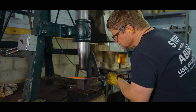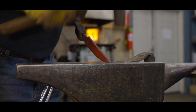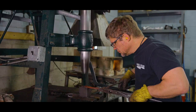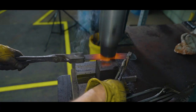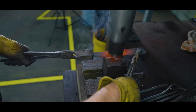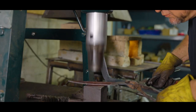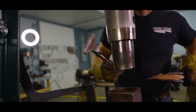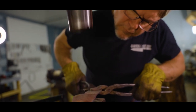We get to be really creative during this step. At this stage the blade is still too thick to become a useful blade. The heel of the blade is thinned down by careful hammering. This step is the most technically difficult, because we are trying to move hot steel in one direction with a round faced hammer. From there, the front half of the blade is forged and then forged lightly a few times after that to even the blade out.